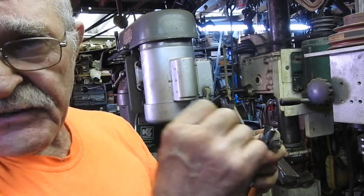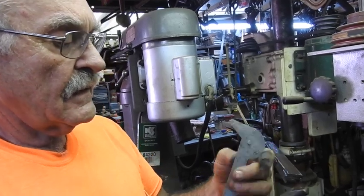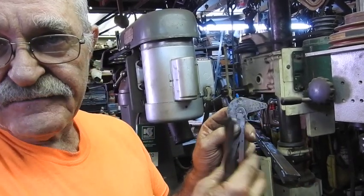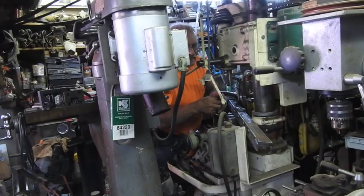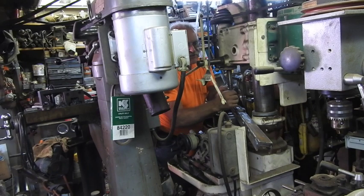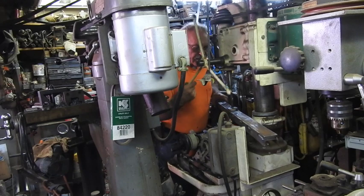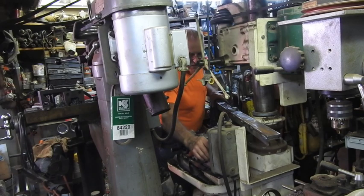That's not looking too bad. Remember, 118 degrees included angle - keep your eye open for that gauge at a yard sale. The good thing about the Morse Taper number 3 chuck: all you have to do is line this flat spot up with the hole and slide it in, and friction does the rest. It may fall out until you put a little pressure on it the first time, but once you put pressure on it, it should be just fine. So I'll pull this in here, get centered up on the hole again, and get a little fresh cutting oil in there.